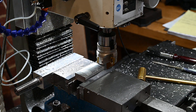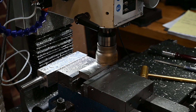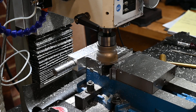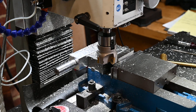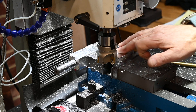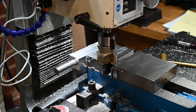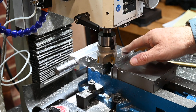So I'll cut that back to 1000, try another pass back the other way and see what I think. Lovely — that's very nice. So for this particular machine and this particular cutter, I don't know what the feet-per-minute feed rate is, but on aluminium about 1000 RPM is about right for this cutter to give a nice finish.